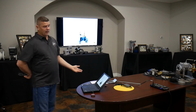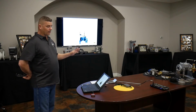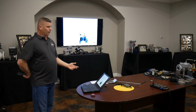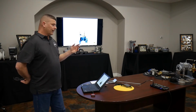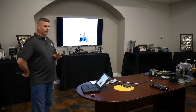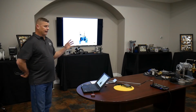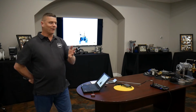So this has rangeability that can beat anything on the market, anything, okay, with the step drill hole throttle plate design, which we'll talk about. It's a carbon steel body, all rated to 1,480 pounds. So the only thing that is going to determine which model we spec, as far as the body size and end connections, is what's going to fit best in their piping. So when we get to asking questions about application, we want to know those things, so we spec the right connections, because the body doesn't care. It can handle the pressure. What's going to derate it is the connections.